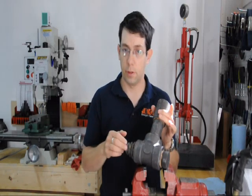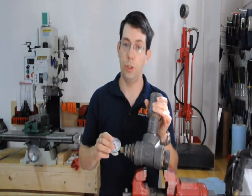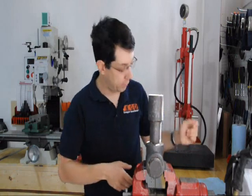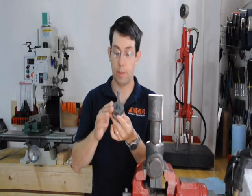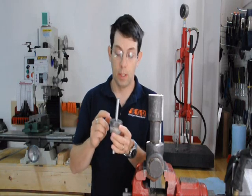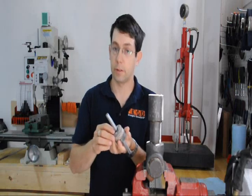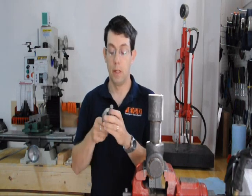Most of it is just 2 inch pipes rated at 3000 PSI. We have a 3000 PSI rated gauge. For pressurizing it, all this is is a 2 inch cap rated at 3000 PSI with a hole drilled through it. You have two hydraulic seals rated at 3000 PSI and a half inch piston that goes through the middle.